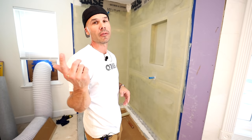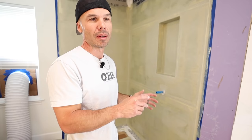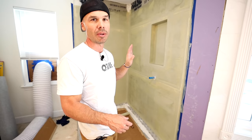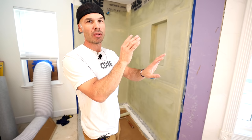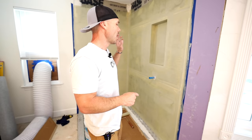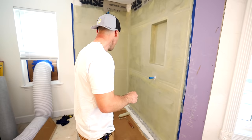The first coat is up — that went really fast, seemed like only about 15 minutes. We need to let this coat dry completely before we put another coat on it. That's another big mistake I see being made: not waiting until that first coat is fully dry. If you still have wet material and you put another layer over it, it's like sealing it up — that bottom layer won't dry. When it gets wet or vapor goes through it, it will bubble up and start to peel off. How you know it's dry is when it turns a dark olive green color. You can already see it starting to dry in certain areas. Hopefully it only takes about an hour.